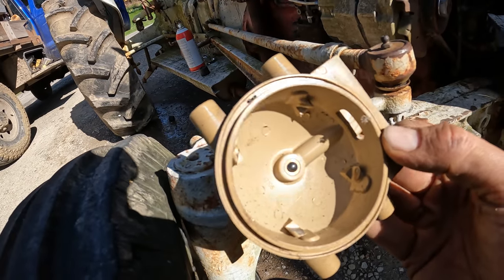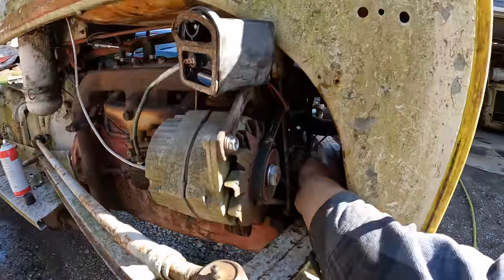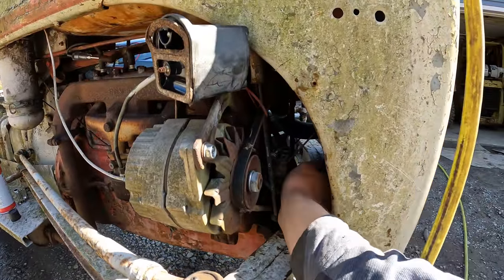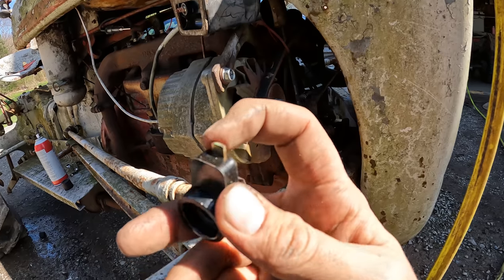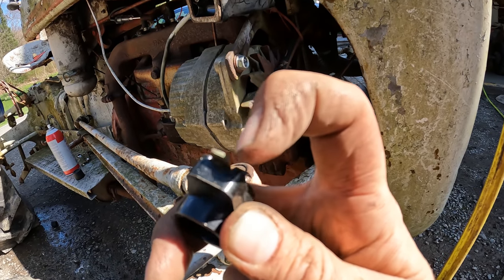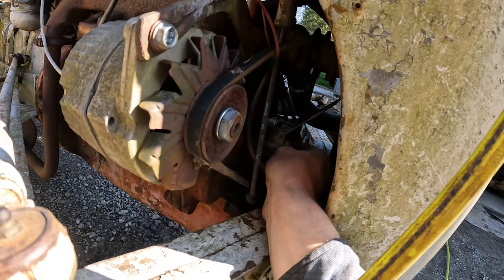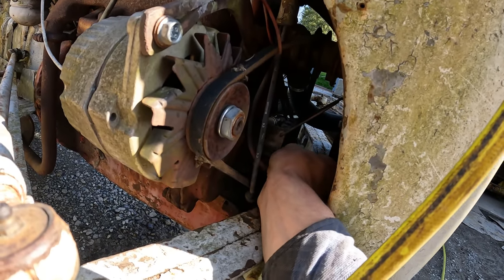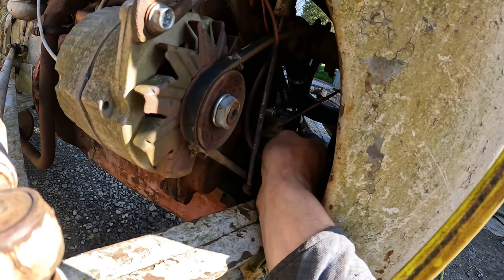Still an ant lingering in there. Also pull this rotor cap off of here. Let's see what we can't find in there. Yeah, it looks pretty good, except the contactor out here at the end. That's pretty crusty. We'll clean that up too. There should be a set of points down underneath of there, which could also be dirty. That could be causing our problem. But man, can't hardly get in there to look at them.